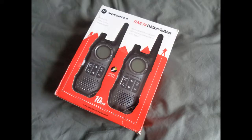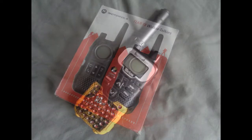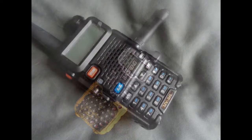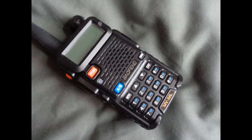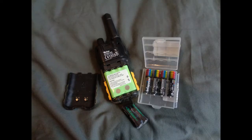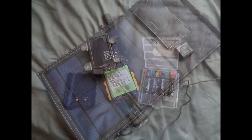If you're going to store your personal mobile radio for long periods, it's best to follow the manufacturer's instructions. It's usually a good idea to store them with a newly charged battery pack. The worst idea is to use individual, primary or single-use batteries that are going to leak over time. If batteries run down in the field, the best option is to carry a spare battery pack, or carry single-use, non-rechargeable batteries.